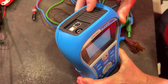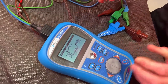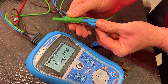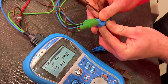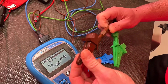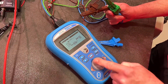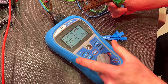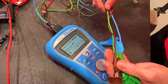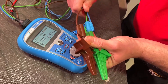In the top of the machine we're going to slide across in order to put in our adapter — we pop that into place. As we drop back down we've seen that these leads need piggybacking, so we've got the neutral one and the protective earth one joined together, and our line lead separately. I'm going to use my crocodile clips in order to carry out this test. We pop those into position and now we need to come back out of this screen by pressing the help button once again. Now we're back to where we started and we can test that the leads are in good condition — proving there's no damage at the connection for the crocodile clip.